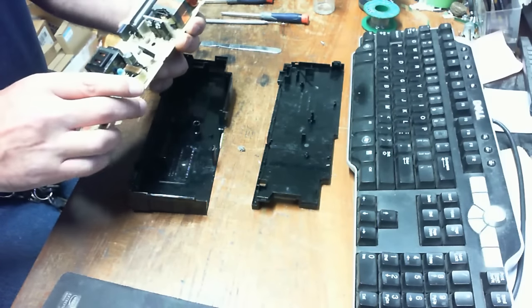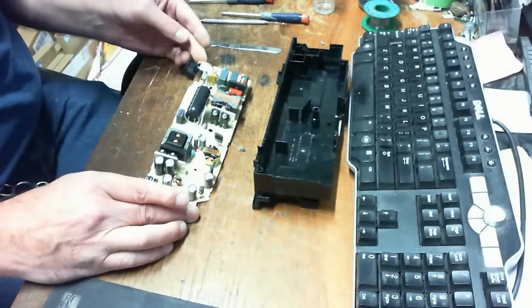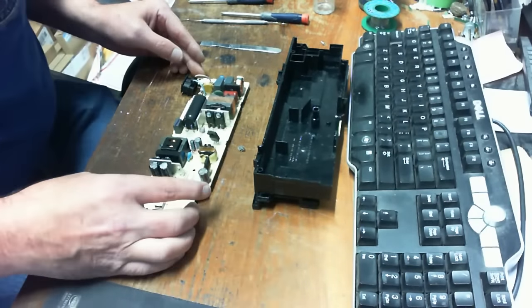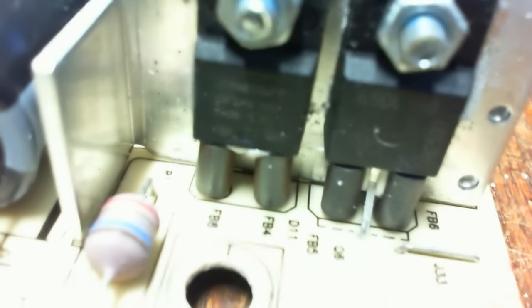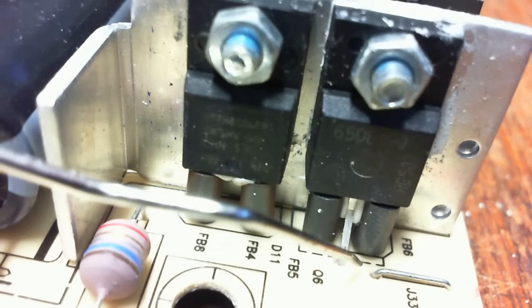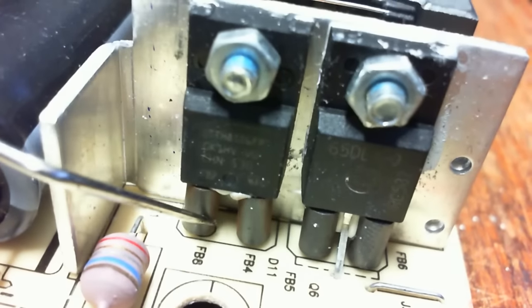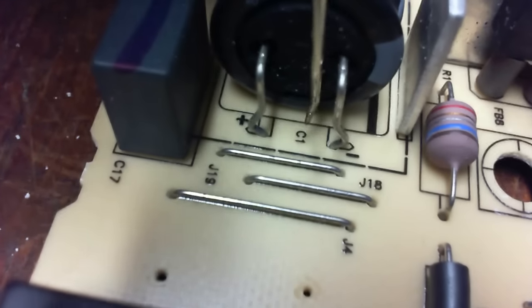Okay, so we're going to take a high temperature sealant, 704. You can get this on eBay. I'll put a link to one in the video description. I don't know how long it'll last. It comes out somewhat runny at first, which makes it pliable. So make sure you get a decent coating on it, let it settle a little bit, and then start making sure everything's covered.